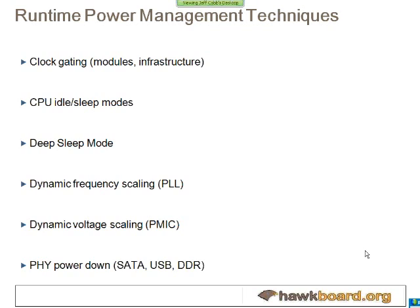These chips are good for low power, and the techniques used to achieve that include clock gating — you can turn off the clocks to any one of the modules inside the chip, the DSP, the ARM, or any of the peripherals. We have low power sleep modes getting down to 14 milliwatts in deep sleep mode. We also have dynamic frequency scaling — when you don't need high frequency for any processing, you can scale that down along with the voltage to consume less power.